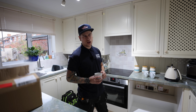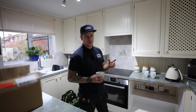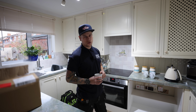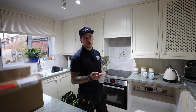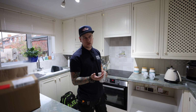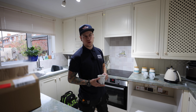There was a lot of downlights that failed, you know, you've got single insulation hanging out of them, earth's cut off. The customer's actually changed them all himself to IP rated fittings. So what I'm gonna do is just send Reuben round, pull them down, check the connections, check it's all as it should be. And then it saved Reuben a job for a few hours.